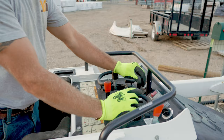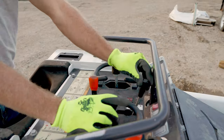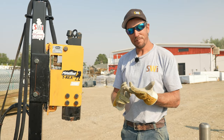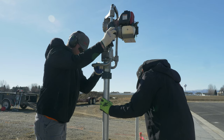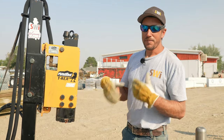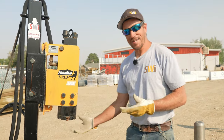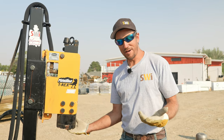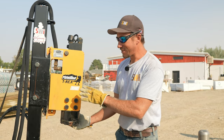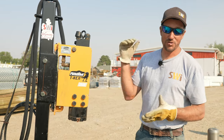This is another option and definitely well worth it. It's so compact that it can get into small areas. If you're on a job site with minimal equipment access but you're also facing bad ground and your Rhino driver is not going to be able to get your posts driven through that bad rocky soil, this would be the next step. You don't have to have a full-size skid steer — you can use it with the MT-85 — and this has more driving force than the Rhino driver. It can hit harder and bust through that rocky ground.